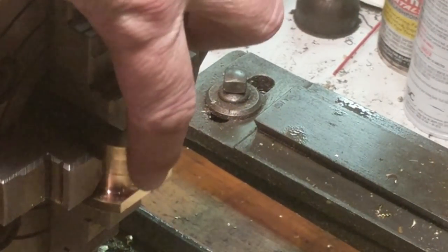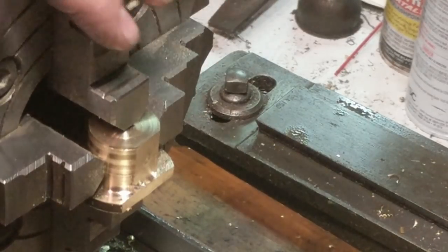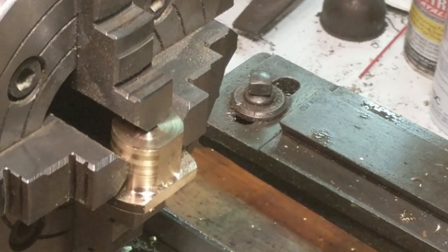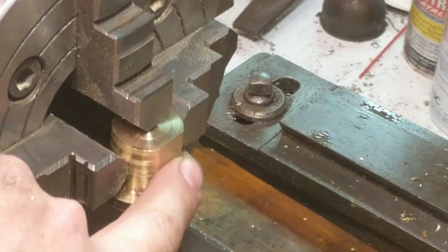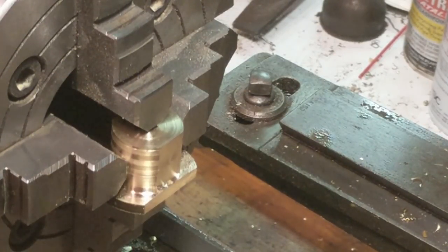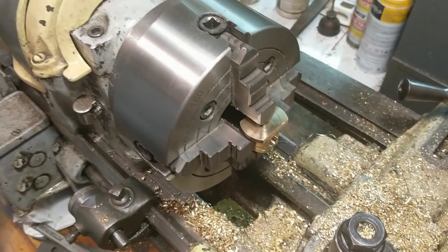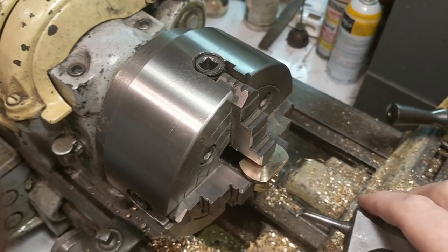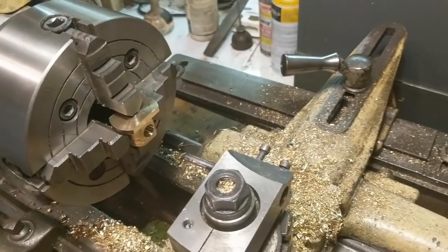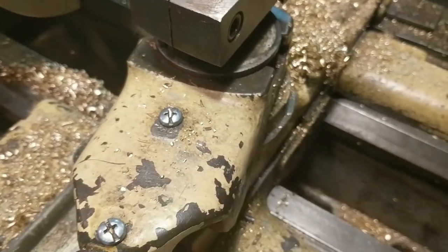The offset from the top to the threaded hole is 0.384, so I set the caliper to 0.384, struck a line across here, and then struck a line in the center. I've spent some time getting it lined up on both those lines. The tap drill size for the half-inch dash 16 ACME thread turns out to be 7/16 of an inch — center drill, drill at 7/16, then thread it for 16 threads per inch. I've center drilled it, drilled it at 7/16, and then bored out another seven or eight thousandths to our final size — a nice clean straight bore.